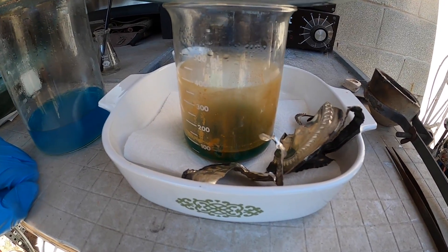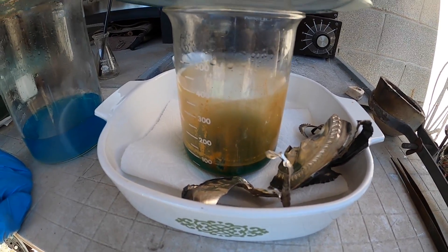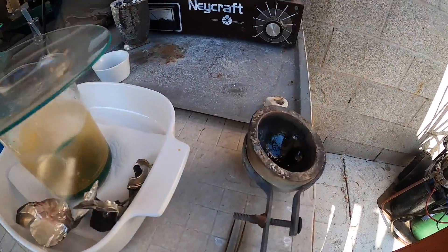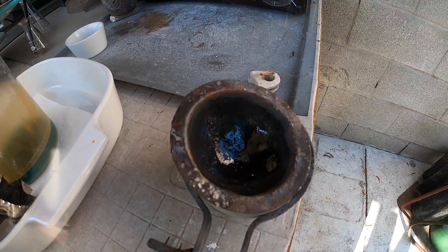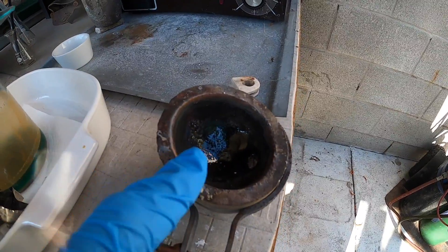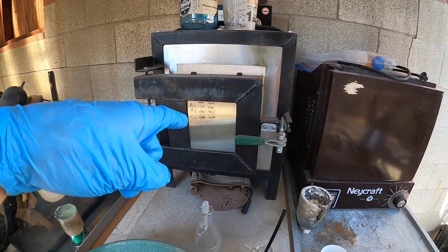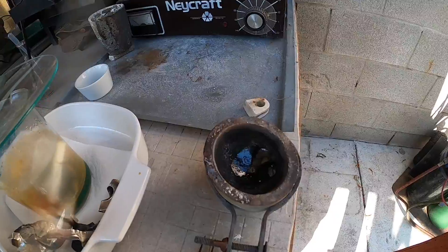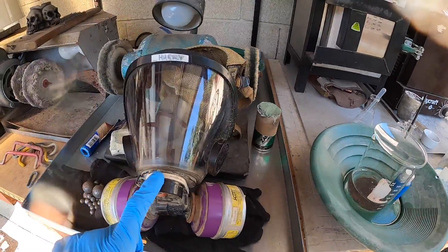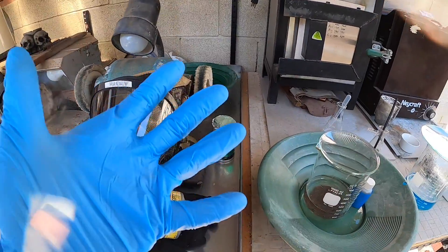So I get a free refining step for sterling silver, and I'll do another video on what we use that silver for later. Once I remove all the gold out of here and rinse it, I'll put it into a melt dish and slowly heat it up until I get my button. Another method would be to put your melt dish into a furnace, which is the preferred method, but I can do it without really losing any gold using oxy-acetylene and propane. Note: always wear a respirator when dealing with acids, and also a face shield and obviously gloves.